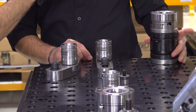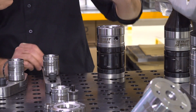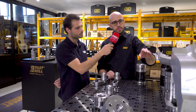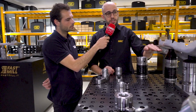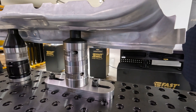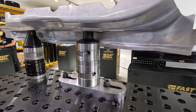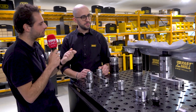We also have a height adjustment system, and recently we developed a new system that allows clamping of metal parts that are not planar on the surface. So for non-planar parts you have a little bit of angular adjustment — which shows that it's not just for machining standard billets, you can actually handle many different types of components.